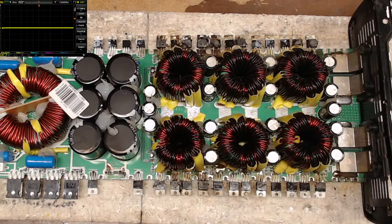You know, Damon, that's what I was looking at. I don't know. That was a 60 amp single diode. And I could not tell where or what that was rectifying. I don't know why they would have such a big rectifier. I didn't really investigate the traces on that, but I would assume that. No, see, because the auxiliary power supply transformer has discrete diodes in front of it, so it's not that. I don't know. That's a very interesting diode that's sitting in there because it's the only one there. So, not sure. Oh, hey, thanks, Big Stone. Thanks for that. I do appreciate that.